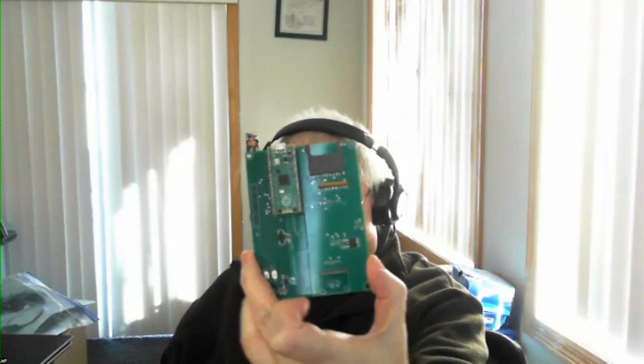And I did check, I can actually get FPGAs, so I'll probably end up building some more FPGA boards just to verify the design. After that, I have another daughter board that's going to plug onto that FPGA board that will allow me to gain access to the SD card and a serial port. Right now, this is an old version of the Raspberry Pi Pico that doesn't have Wi-Fi. I did order some that did, and ultimately I'd like to get Wi-Fi working as well. Wow. So that's kind of where we're sitting right now.